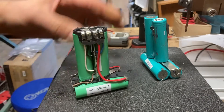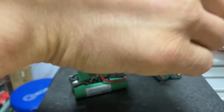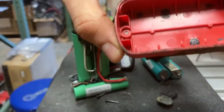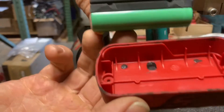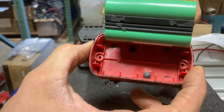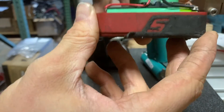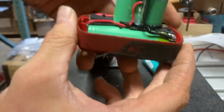That's pretty much it — and there you have the pack. One little detail: inside the base of the pack you'll see there's a little loop here and a loop here, and those match up with the loops on the cell assembly. My loops are pointing up so they fall right in there. Otherwise it'll be slightly too tall — you can get the screws in and seal it, but it's going to be stretched. You don't want that.